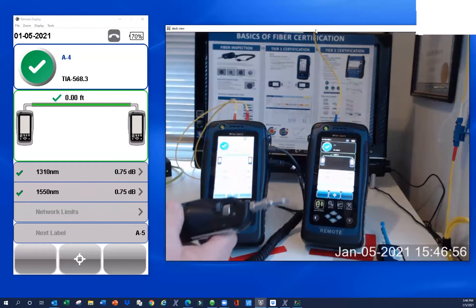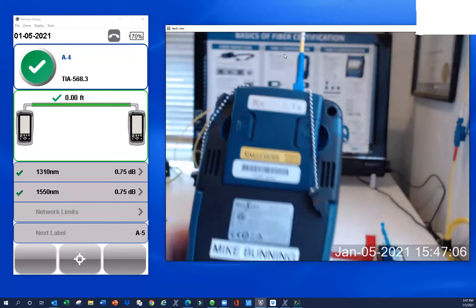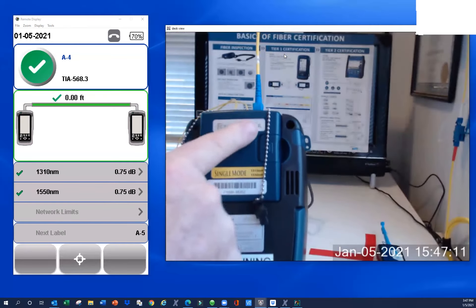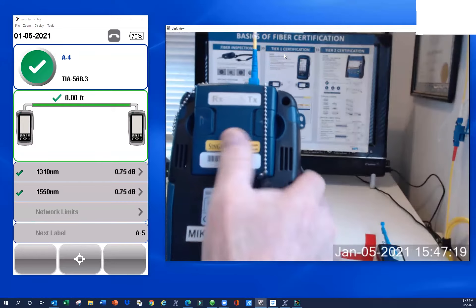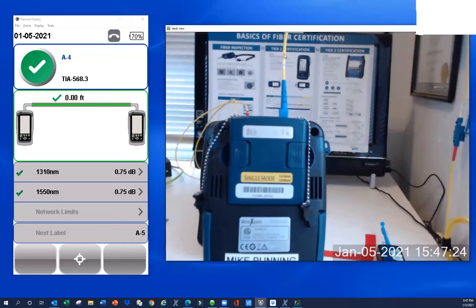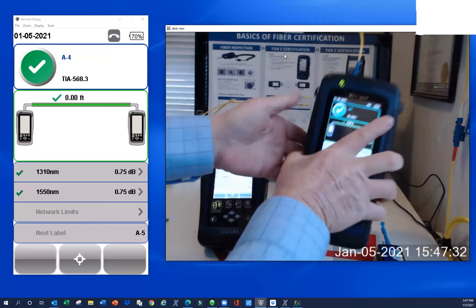Sometimes you'll win, sometimes you'll lose, and if you lose it can be very painful. You can spend a lot of time, and in the worst case scenario when you put that connector down inside the transmit port, it's glass on glass — you stand a chance of embedding that dirt into your adapter end face. These things are not inexpensive, and I've seen cases where dirt was embedded so badly we couldn't even clean it in the lab. Always start with clean end faces.